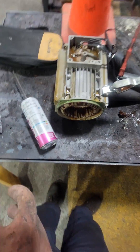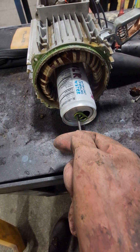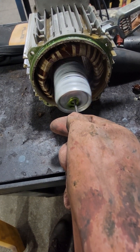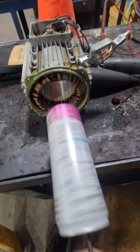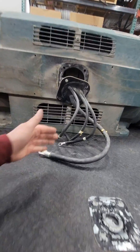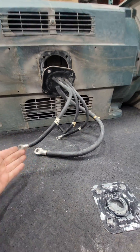We're going to do that flipping on and off at 60 hertz — 60 times per second. I'm only putting 21 volts into this thing, which doesn't take a lot of voltage to get that magnetic field going, and our current is going to be up towards nameplate rated current. We can stick a test rotor in there. Now this other one here is 700 horsepower, 4160 volts, only 92 amps because our voltage is so high.